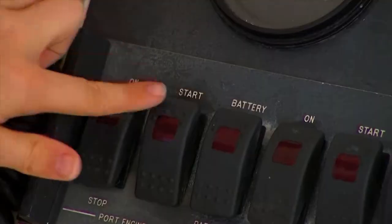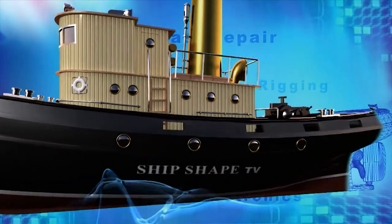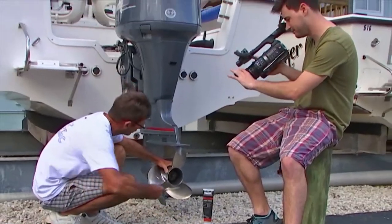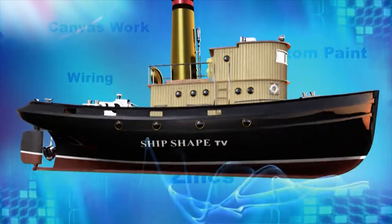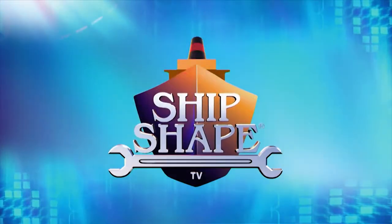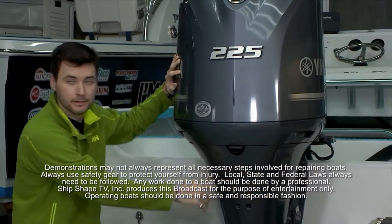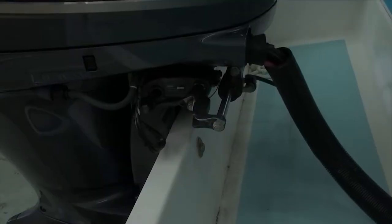It's time to fire this thing up! Jonathan, now try the other side. I'm having him check for air in the system. If there's air in the system, the motor will move back and forth. If there isn't, if it's just oil, that motor will be rock solid.